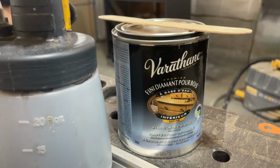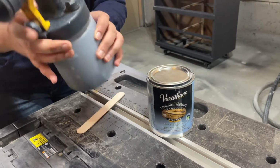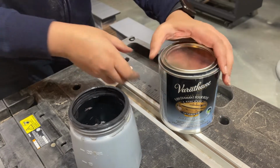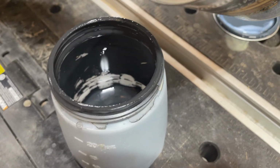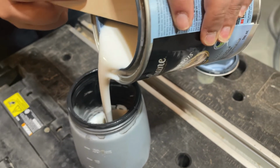After spraying 3 coats of paint, I then went on to add some polyurethane top coat. So even though Fusion Mineral Paint has a built-in top coat, I always add additional polyurethane top coat on top of this. Because I'm selling my pieces, I want the finish to be as durable as possible.